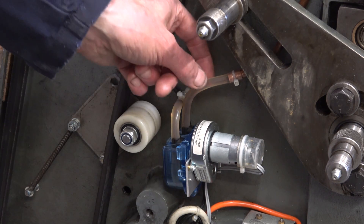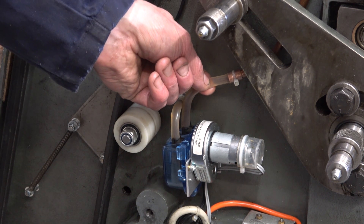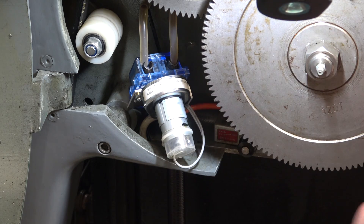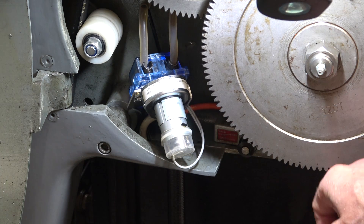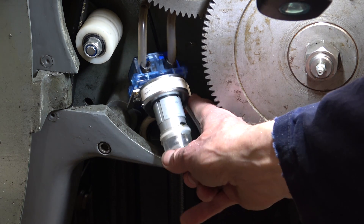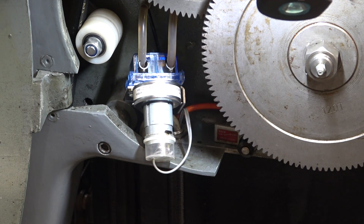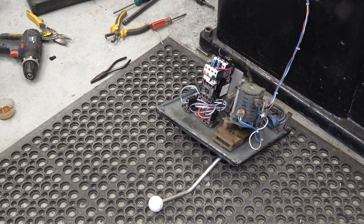It's certainly strong enough — I can feel it really pulsing in that pipe when I squeeze it. I'm trying to make this gearbox a bit quieter; it sounded awful, as if it was about to seize up. There's a slot over here and I managed to squirt some lithium grease into that. I've also made this neoprene strip which I'm going to put under this foot here to hopefully noise-isolate it from the body of the lathe. One good thing to come out of this — I can take that old setup away. I just didn't have a power supply that was 5 volts and big enough, other than that computer power supply.